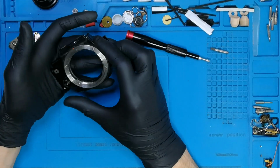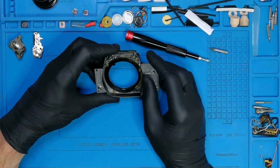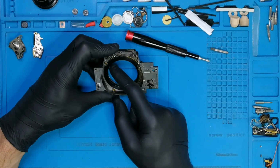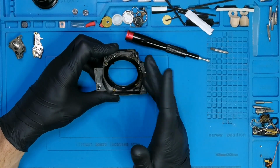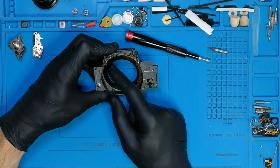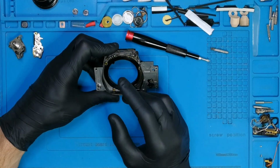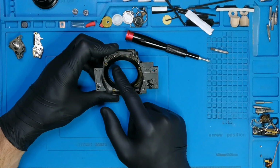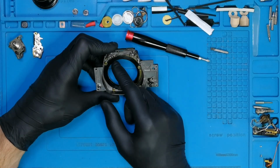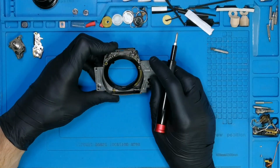I do have the front plate from the second camera. So when you mount a lens, this tab will be rotated like this, slightly, depending on what maximum open aperture you have. So if it's 1.7, it will go a bit. If it's, I don't know, 2.8, it will go a bit more. If it's 1.2, it will probably not move at all, because 1.2 is the lowest figure in the viewfinder, the lowest number. So it moves a bit. Moving this a bit will also move this pulley a bit, and the pulley is what shows you the aperture.